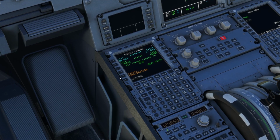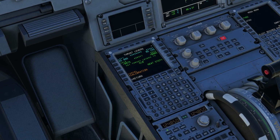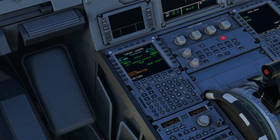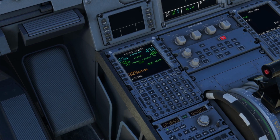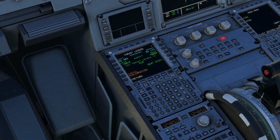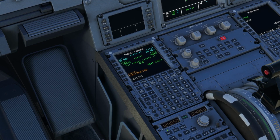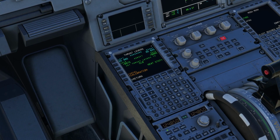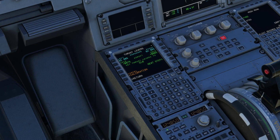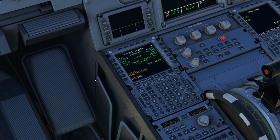Right, so let's push the levers all the way to climb. There you go. Now again, what you see on the screen per values of the potentiometers, they are slightly different. Just make sure that when you check the throttle physically, they are sitting on exactly the same detents for both. And then we click next step.